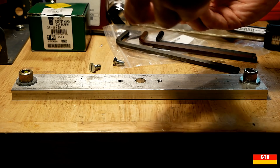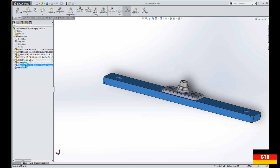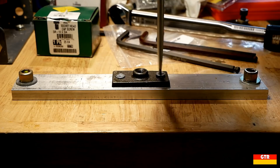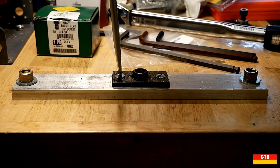These particular plates have a 3/8-16 thread. The test setup is shown in this 3D model. I designed a mounting plate that can be bolted to a bench for a more controlled setup. I used two grade 8 washers because I was concerned about the top of the plate not being totally flat. The screw I'm using is an alloy steel 3/8-16 socket cap screw, and the test plate is screwed down to the mounting plate using 1/4-20 flat head screws. I opened up the mounting holes slightly and ran a tap through the threads to clean up any grime or paint.